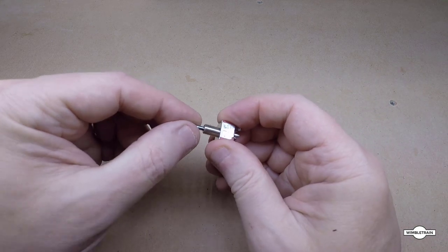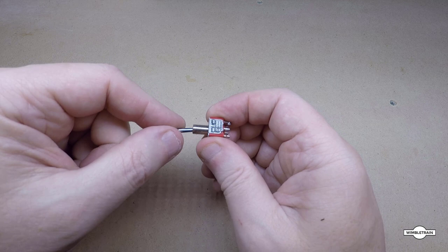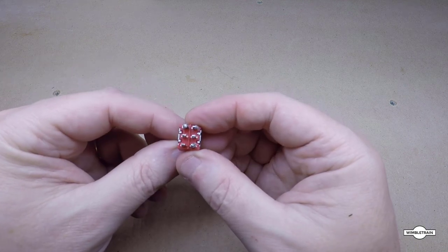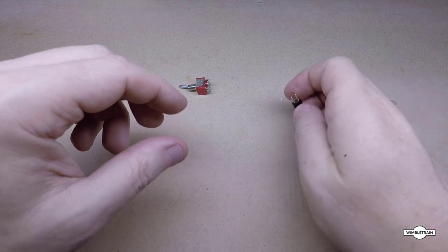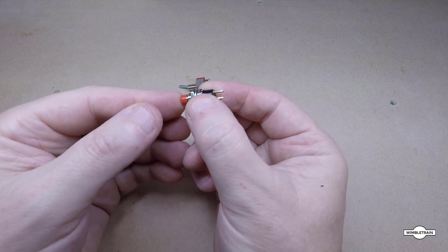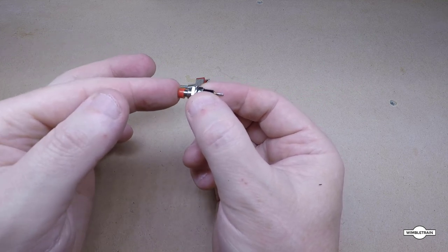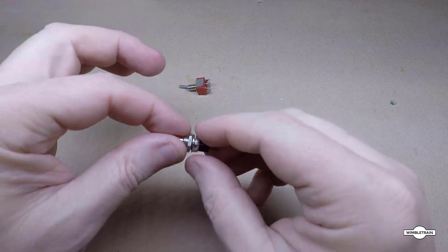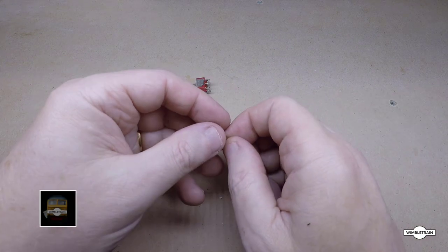The items we'll need to build our circuit: a toggle switch — this is a two-position switch called a double pole double throw, or DPDT — with six connections on the back. We'll also need a momentary push button, which means these two pins are open and if you press and hold it down it shorts those two pins, making a circuit. As soon as you let go it opens back up. It's very important you get the right switch — a momentary push button switch.